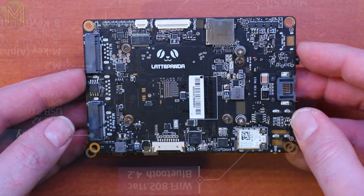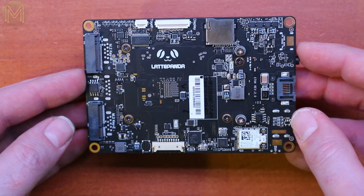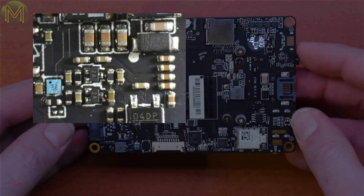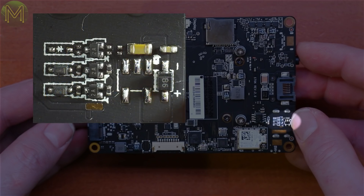The board I have varies slightly from all online documentation, so I'm guessing that it's a more recent version. Moving on to the chipsets — Latte Panda haven't released any schematics for these SBCs, but we can poke around a bit on the PCB. Starting from the top right, we have a bunch of p-channel MOSFETs, an unknown semi but possibly something to do with power control.